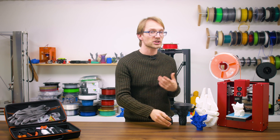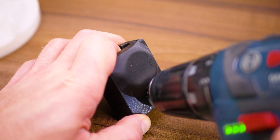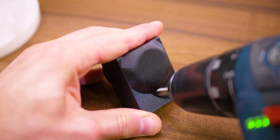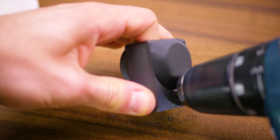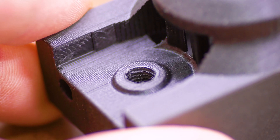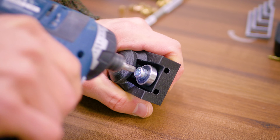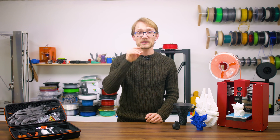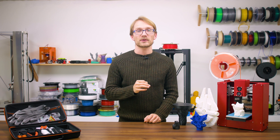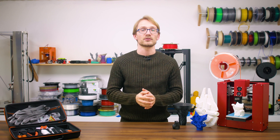What you can definitely do is use machine threads with your parts. A lot of people don't realize that you can actually tap printed parts and create reliable connections with that. Just give it a bit more thread length to engage — about twice your screw's diameter is a good start. You can find tables of tap drill sizes online; just design those into your parts and you'll be able to tap a good thread into it right away. As always, keep an eye on the heat you're generating, as PLA and copolyesters can easily soften up and melt during tapping.